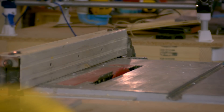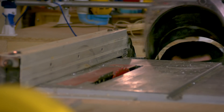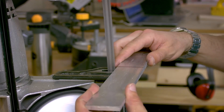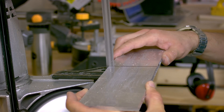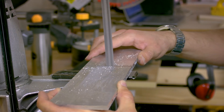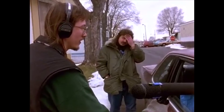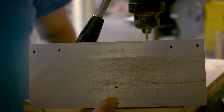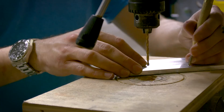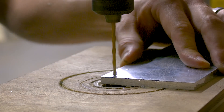The first thing was to cut the aluminum on the table saw — if you haven't done this before, just take your time and please be careful. Next up was to cut the proper width for both pieces on my portable bandsaw. If you don't have a table saw, you can also cut the length of the aluminum on there as well. Now you have the two pieces ready to go. Next up is drilling the pre-measured holes shown in the included PDF. Here I use my center punch to mark all the holes before drilling.